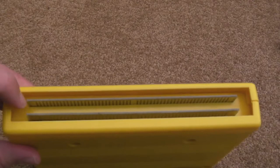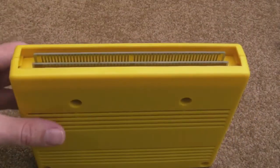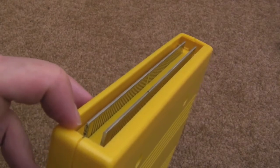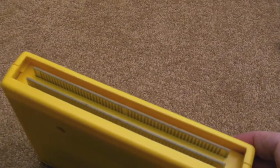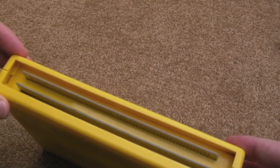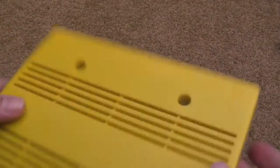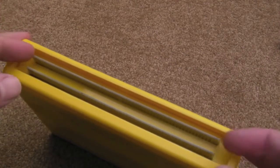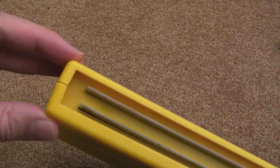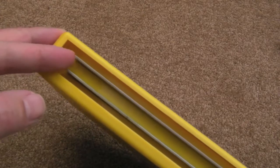Really for my own benefit I wanted to take these boards out and just file a bit of the ends and sides off because it's a bit wide. You can probably see this is just a bit of black plastic on the end — that's because they get really wedged into the cart slots. So it's a really tight fitting cart, and continuously inserting and removing this you're going to damage your socket on your Neo Geo board. And it seems to be only on the 161-in-1s. The other multi carts I've had don't suffer from this problem, but I've read previous complaints on forums, people saying they were to file the edge of the boards down.